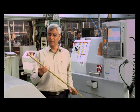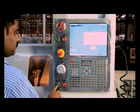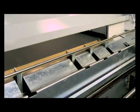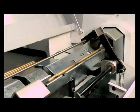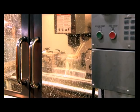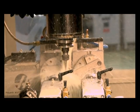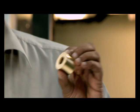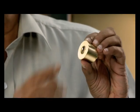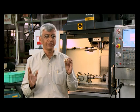Our next step is machining these brass extrusions to manufacture the rotor blanks. After turning, the rotor undergoes broaching and is then further machined on the Haas VMC. Concurrently, the housing is processed in another cell, and then this housing and the rotor sub-assembly go for further processing to the surface finish department.